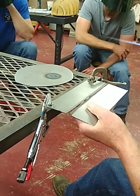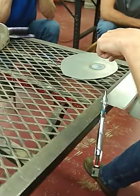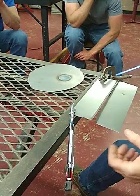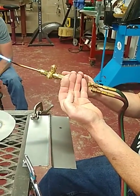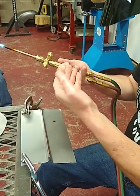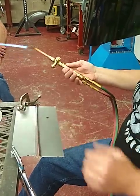That tiny little tack — it's not a big piece. Once it cools, theoretically it should hold it. The heat goes 360 degrees. When you have an edge, it wants to burn back — that's why everybody has a little nugget on the end of the weld, on the starting or finishing. If it's 30 thou material with a tipped edge, you want the bottom two edges to touch — you want that full metal thickness exposed. When I heat it, those two surfaces have to touch, and once it's heated up they fuse together, no filler required. Have filler rod handy in case you burn a hole. Until then, we're just using the material on itself.